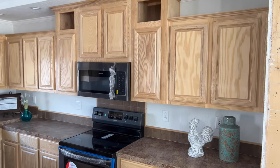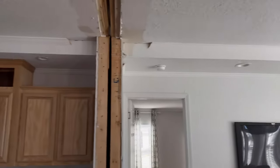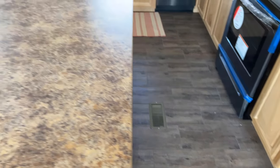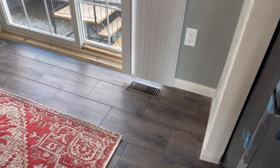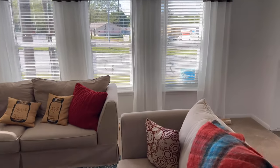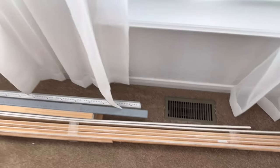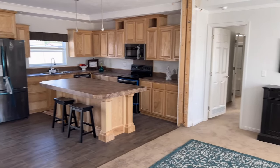Something I wanted to mention — you'll notice there's no vents in the ceiling. Solitaire does offer ceiling vents as an upgrade. This one has vents on the floor. This one has what's called perimeter air, so in your main areas where you have plenty of traffic, the vents are going to be relocated six inches away from the wall. So you've got one vent there, another one here in your living room, and I'll show you the bedrooms as well — they're going to be six inches off the wall.